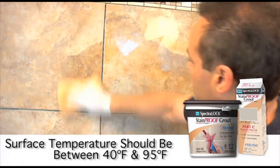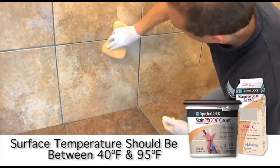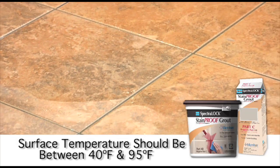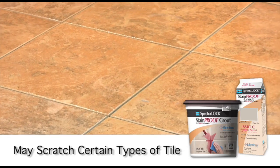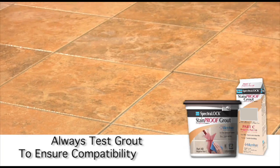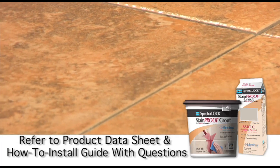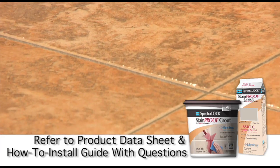The surface temperature range for installation of grout should be between 40 degrees Fahrenheit, 4 degrees Celsius, and 95 degrees Fahrenheit, 35 degrees Celsius. It is important to remember that LATICRETE SPECTRALOCK Grout, like other sanded grouts, may scratch glass tiles, soft or polished marble and stone, soft glazed, and handmade tiles. You should always test the grout on a small area to avoid damage and ensure compatibility. If you have any questions before you begin, refer to the product data sheet and how to install guide for detailed installation instructions.